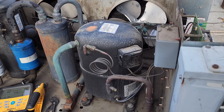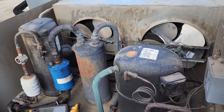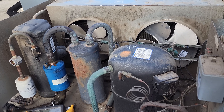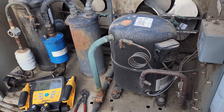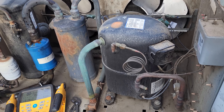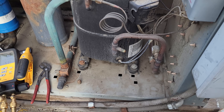We made it through the night. It is the next day and the box is completely down to temperature. The ice cream refroze, which is trash, but that's another story. We are going to put a dual pressure control on this unit — eliminating the old low pressure and high pressure controls. We just have to figure out where to hook into it.